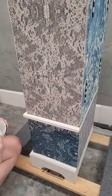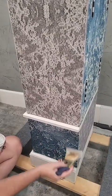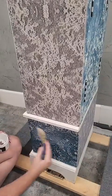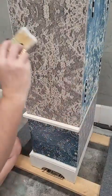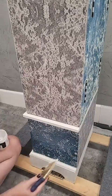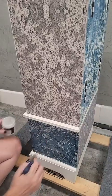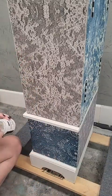With my same brush I brush the decoupage gel over the top, and this is going to seal that paper in. The gel is nice and thick so it fills the light texture of the paper and gives you a smooth, soft, buttery finish. If you have a painted piece and want the sheen to match your whole piece, you can do the decoupage gel and then put your regular clear coat over top — that gives you the smoothness of the decoupage and then you can match the sheen with your clear coat. It's a water-based gel.